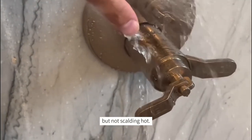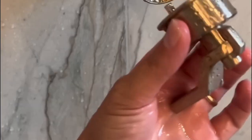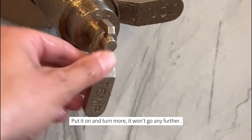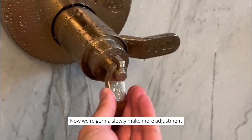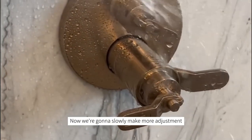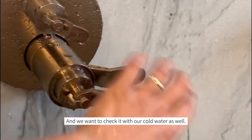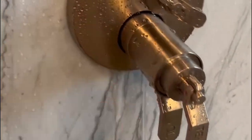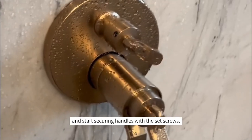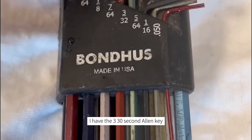We're getting a few seconds to adjust and it's pretty hot but not scalding — so that's going to be the good spot. I'm going to take the handle back off, line up this tooth with this bump, put it on and turn — it won't go further, so that's the hottest temperature. Now we're going to slowly make more adjustments to check for warm and cold water as well. It's all fixed. We turn the water off and start securing the handles with the set screws using a 3/32 allen key.